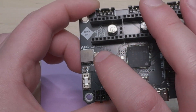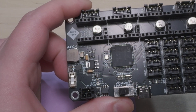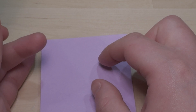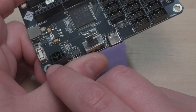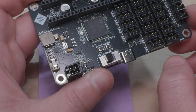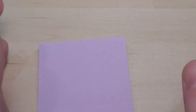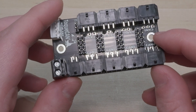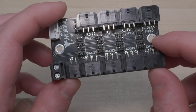In a star-topology hub setup — mounted on the back or bottom of your printer — you'd have a fairly long cable running to your tool head, meaning the stub length could be considerably longer than 300mm. And that's not just the cable: there are also PCB trace lengths on the hub, the connectors, the cable itself, then the connector on the tool head board, and the trace length to the CAN transceiver on that board. They all add up. If you use a CAN hub that follows star topology, you're not following the recommended CAN specs, which may explain some of the issues people have had with CAN devices connected to hubs.